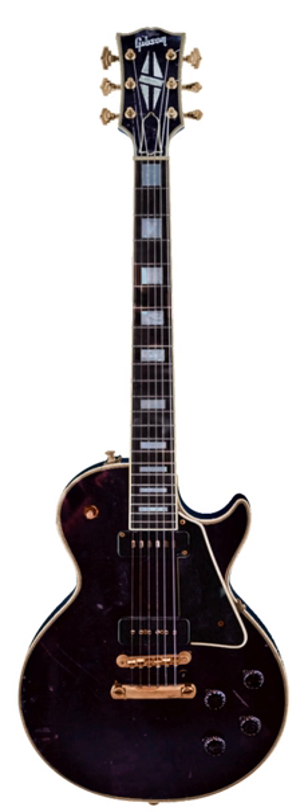Some steel string acoustic guitars are fitted with pickups as an alternative to using a separate microphone. They may also be fitted with a piezoelectric pickup under the bridge, or with a low-mass microphone inside the body that converts vibrations into electronic signals. Combinations of these pickups may be used with an integral mixer, preamp, and graphic equalizer. Such instruments are called electric acoustic guitars. They are regarded as acoustic guitars rather than electric guitars because the pickups do not produce a signal directly from the vibration of the strings, but rather from the vibration of the guitar top or body.